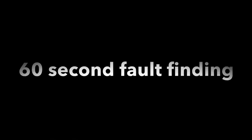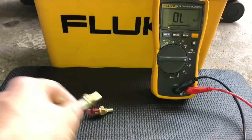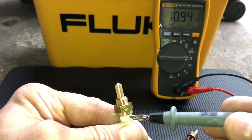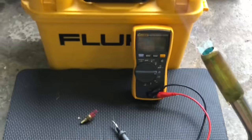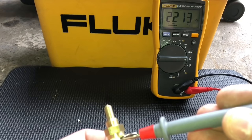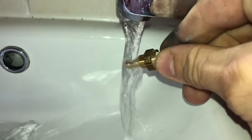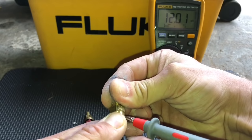Quick video on boiler fault finding with NTC sensors or thermistors. Grab your multimeter and change it to the ohms setting — mine's auto-ranging but yours may need setting manually, around 20k. On those two pins we're getting resistance of around 11,000 ohms, which is about room temperature — that's right. If we warm the thermistor up, the resistance decreases; we're now getting about 2,000 ohms. As it cools down the value increases back toward room temperature. Cool it under a cold tap and the resistance will be higher — about 14,000 ohms. The resistance simply changes according to what temperature it's reading.